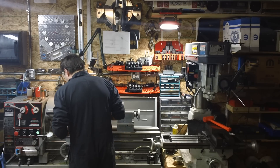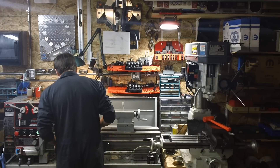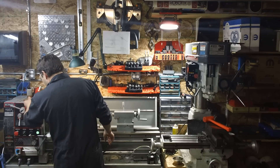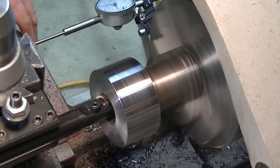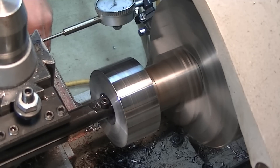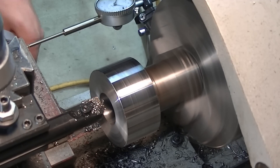I've got the poor man's DRO set up here with two dial indicators for X and Y. According to the print, I need to enlarge the center opening out to 1.52 inches — 1 inch 520. I suppose we could speed that up a little bit. Let's go 1,000 RPM. Let's go to a 15 thou depth of cut and see what happens. This is actually a lot nicer — I just got this boring bar with the CNMG insert. It actually works out fairly well. Another 15 thou radius, 30 thou diameter.